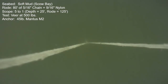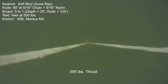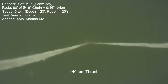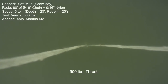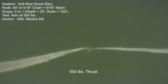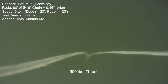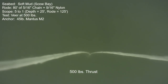Next is a veering test in the soft mud at Scow Bay. I've chosen to use a 500-pound baseline pulling force for large anchors in this seabed — this is only the third anchor tested as such. It has a little trouble; it really can't hold the 500-pound baseline well. I'm getting up close to 500 pounds but the camera tethers are moving downward — that's actually the anchor moving. It didn't hold the 500 pounds, and then when I started to veer, right away within about 10 to 20 degrees the boat speed increased beyond two knots, so I chopped the power and discontinued the test. The other two 45-pound range anchors I tried this veering test with were the Knox and the Viking, and they both did much better.